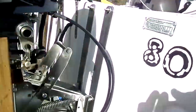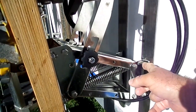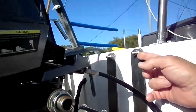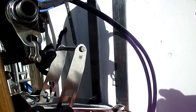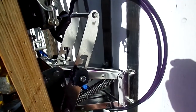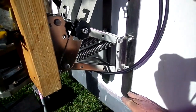Coming back around down here — the bolt coming through here. I've put a tapped thread in here so when the nut tightens up, it tightens onto this bar rather than trying to pull all the way through the transom. So the top pressure here is transferred between here and up here — not into the boat. This is tapped with an 8mm tap. This little bit sticking out is the end of the thread of the bolt, securely fastened to this strap. This one just goes straight through and bolts to the back. I've extended the strap down here because on the inside of the transom, one of the quarter berths — the fibreglass moulding on the inside — comes up to about here and has a lip.